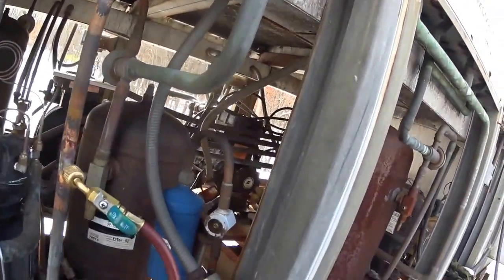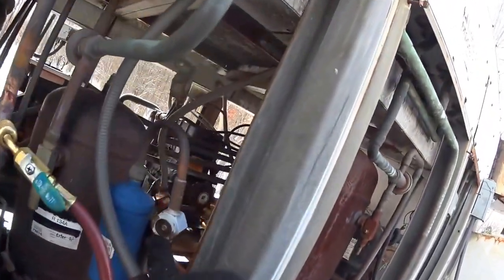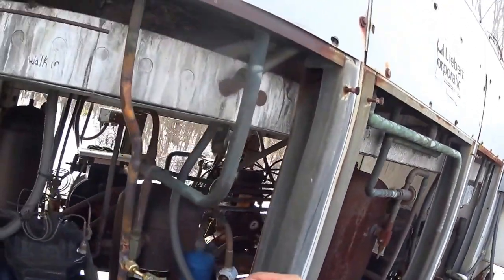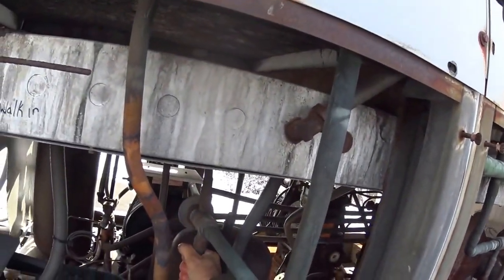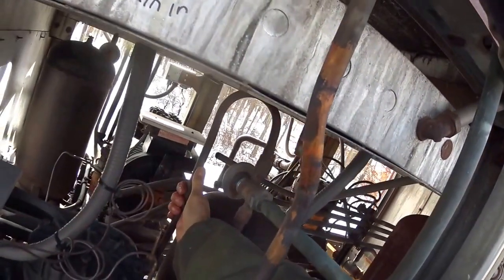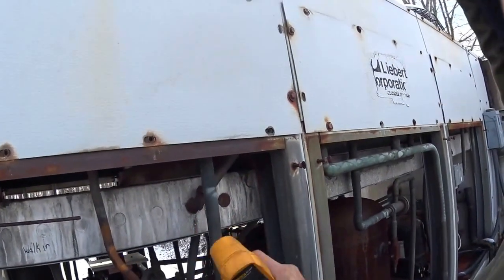We're getting full now. I'm going to let it run for a couple of minutes — see these bubbles still? That's why I want to leave it like that. The line coming back is very cold — the liquid line, big liquid line coming back. This is lukewarm like it should be, and this is my hot gas, and it's really not even that hot — I can hold my hand on it. In summertime I'd burn my skin.